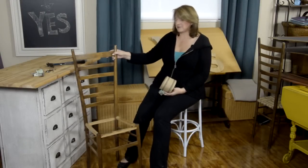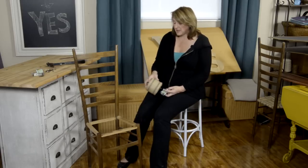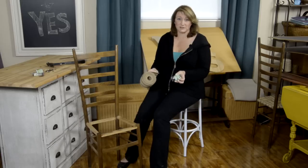Now that we're back to our bare frame, we can start to finish it with a little bit of style. We are going to use jute webbing — it's really hot right now. I'm sure you've seen it woven into pillows, used as accents on bulletin boards and frames. We're going to use it for its intended purpose: it's actually an upholstery strapping and we're going to strap the chair. I found this for between 75 and 90 cents a yard, which makes this a really great deal for a hot look and a strong fiber that will hold as a seat. We're going to attach it to the frame with decorative nail heads. Both of these items will be found in the upholstery section of your sewing store — not with the ribbons and trims, but with the hardware, because it's meant to be under the fabric as part of the frame.